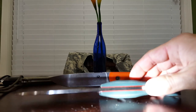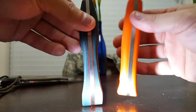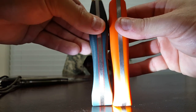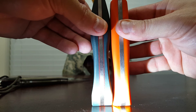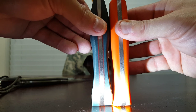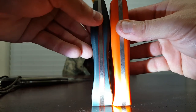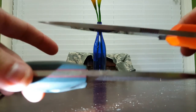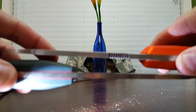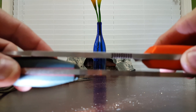This Benchmade Siebert is S30V at 0.160 inches plus the liners. The Koster is CPM 3V at 0.1875 inches — just a little bit thicker. But when the blades actually start, they're about the same size because it drops off a millimeter on the Koster when the blade starts.